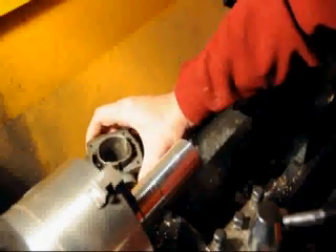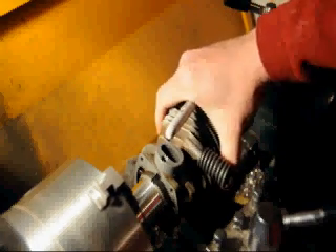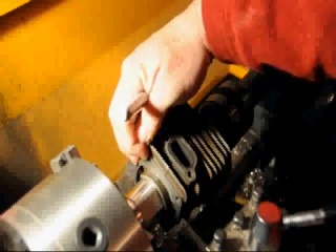Once the cylinder is placed on the mandrel, the live center is brought into the top of the cylinder, holding the cylinder securely against the mandrel. The base can be checked for being square with a dial indicator, but I'm fairly confident that this is square.